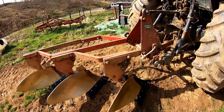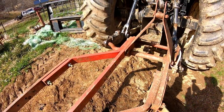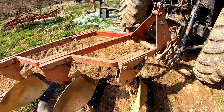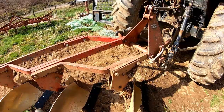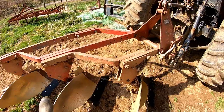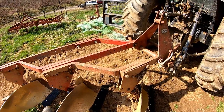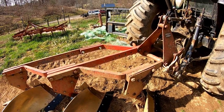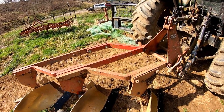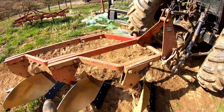What made me choose seven inches of depth? According to the Ford manual, whatever size plow you have, it recommends plowing at half that depth — 14-inch plows, seven inches. Why choose a larger plow? You cover more ground with each pass. What am I trying to accomplish with plowing? Prepping the seed bed — getting that soil loose so crop roots can source the nutrients in that soil, and you get water mobility as well.